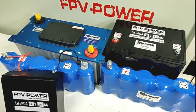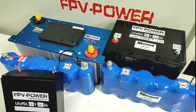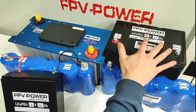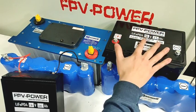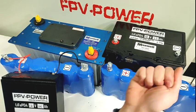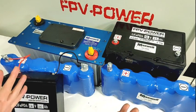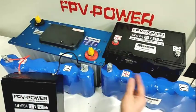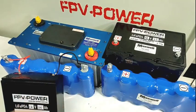And at 10.4 volts, the supercapacitor, because this will always float at the same voltage as your battery, wherever the battery is at, this will always be at it. At 10.4 volts, boom, she cranked over. Nice and strong. First time. And straight away, the alternator will bring it back up within a couple of seconds, 14.4.